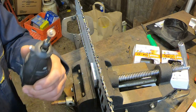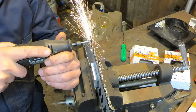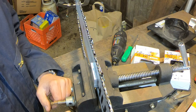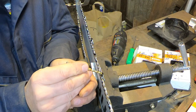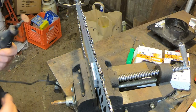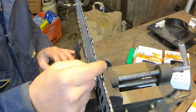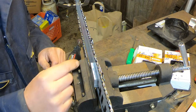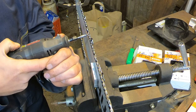The cutoff wheel wore out and broke, so I swap in a new one — with a fresh wheel it goes a lot faster. We hit the point where there are four consecutive teeth to cut, so instead of cutting two-thirds off like the others, I go halfway and leave about one-third to two-thirds of the profile, splitting the difference. Once these last two are done, the chain is complete.